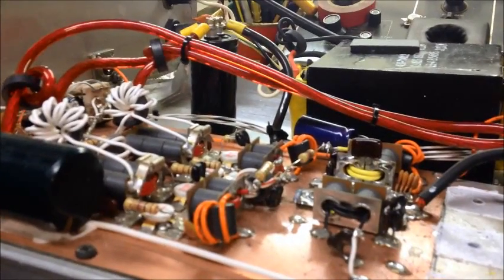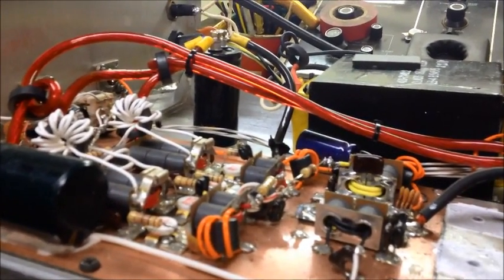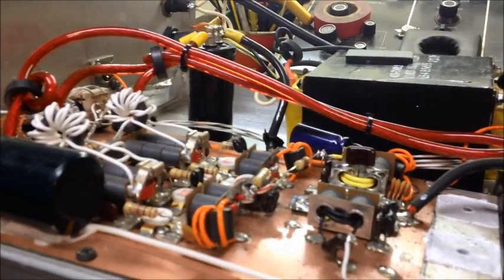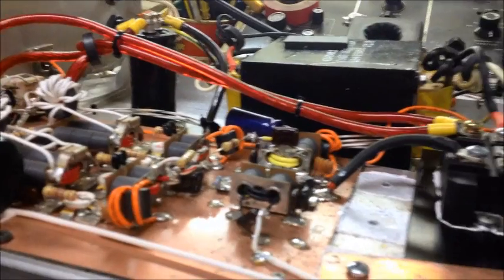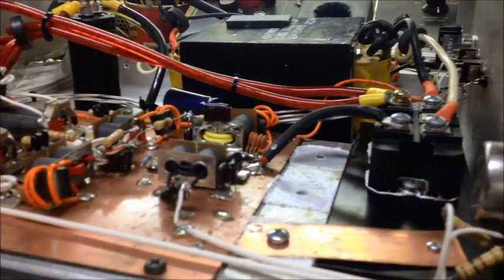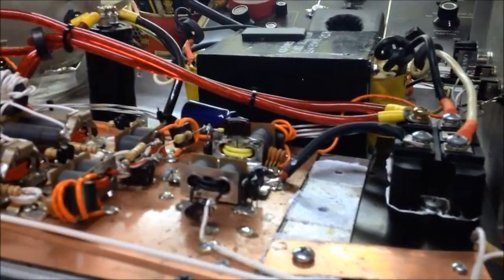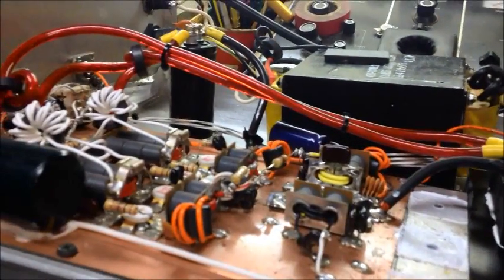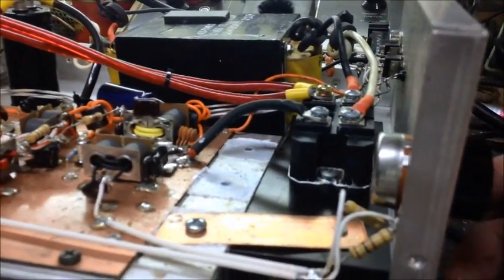With an amp like this, a 5-pill, I wouldn't dead key it more than about 200 watts and let the rest swing. We're talking RMS, but dead key is dead key whether it's RMS or peak, really. So you want to look for about 200 and let the rest swing. You might get away with about 250. I tend to run mine a little higher than most, but if you have a good SWR on your antenna, you can do that.